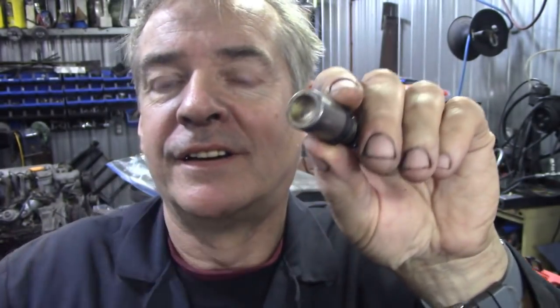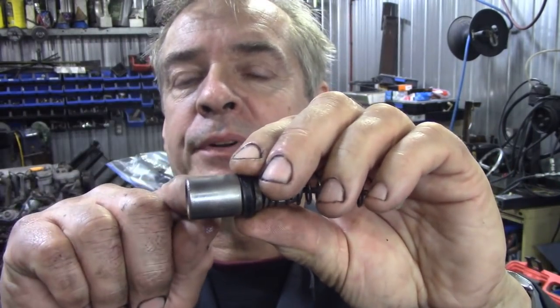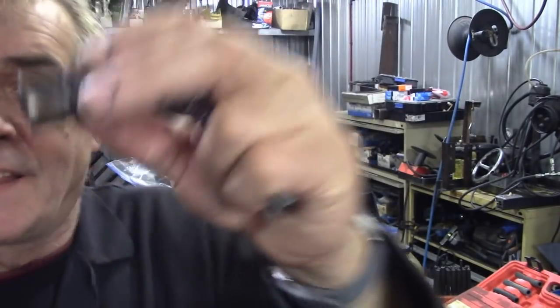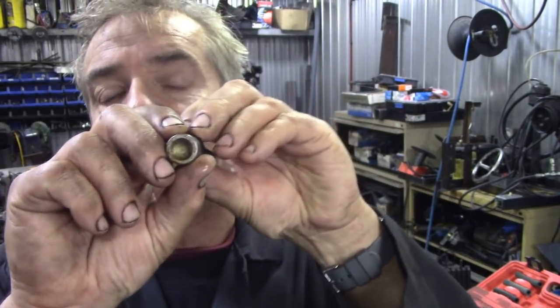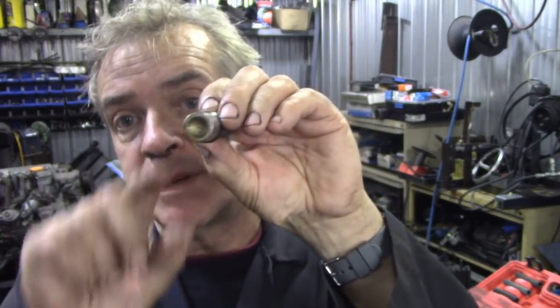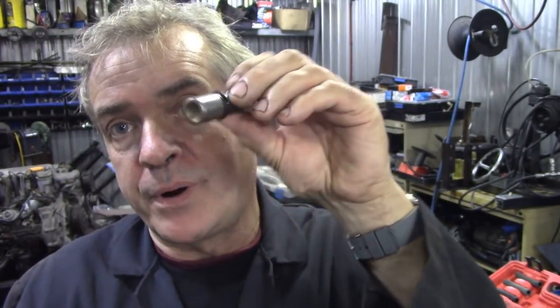So we had to think about it, and JP said, we could put a wear ring on this. I said, what's a wear ring? And he says, we can put this in the lathe, turn a slot down, rather like that, and he can turn some special plastic. This is 3/4 of an inch diameter, 19 mil or something like that, so it can make the exact snug fit inside the diameter. So this piston, in effect, will be fixed in the centre of the bore.